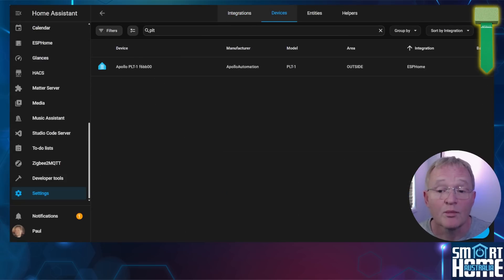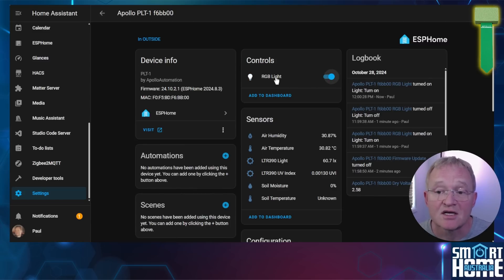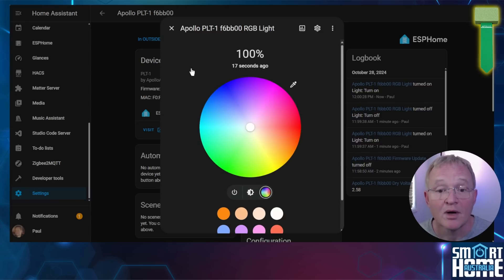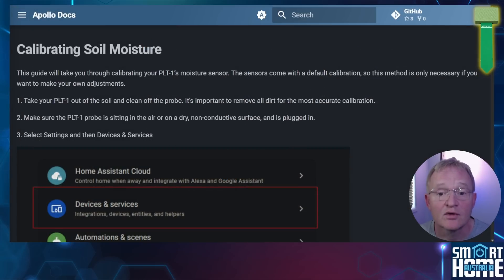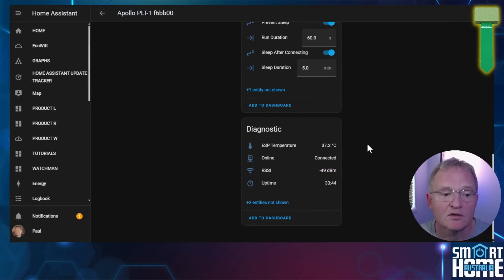Press devices, search for PLT and select your new PLT-1. In controls you can toggle the LED light and set it to one of 16 million different colors — remember you can also automate this LED to display red, amber or green for moisture levels. In sensors you get the air humidity as a percentage relative humidity, the air temperature, the lux levels showing how much light is hitting the sensor, and the UV levels telling you if your plant is getting the right type of light. The main sensor is the percentage soil moisture, which shows zero when out of the soil, so it appears to be pre-calibrated. There is a wiki that takes you through the calibration of this sensor which I'll link in the description — it's super simple.